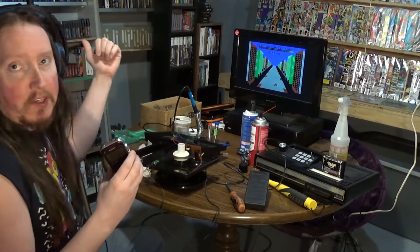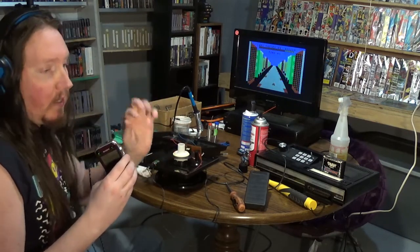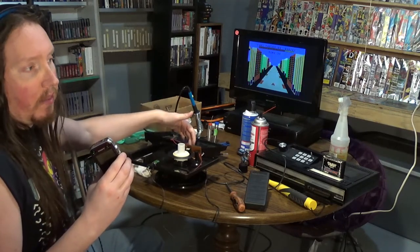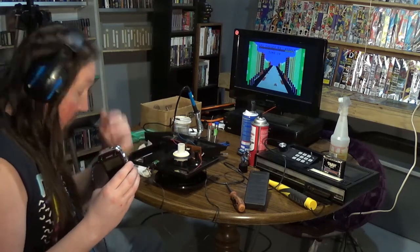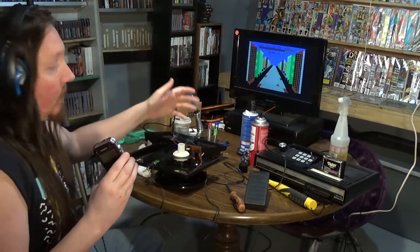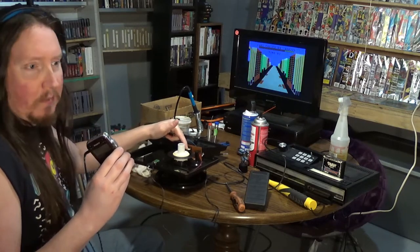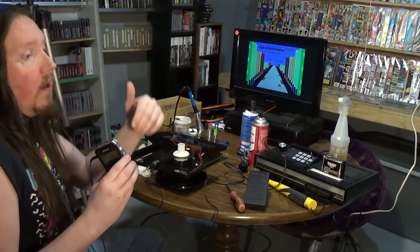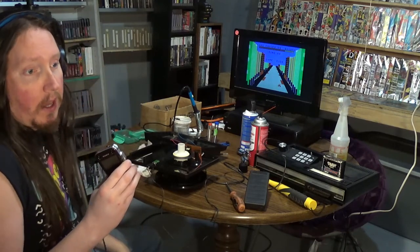I'm wondering if it's this little piece — I'll get the camera going and show you. I looked up some information on the internet and didn't find a whole lot; there was only a tiny bit from Atari Age. Somebody said it could possibly be this little piece, or it could be the battery connectors — where you plug the C batteries in — that might be all messed up. I'm going to try to clean up the battery connectors and hopefully get it to work.